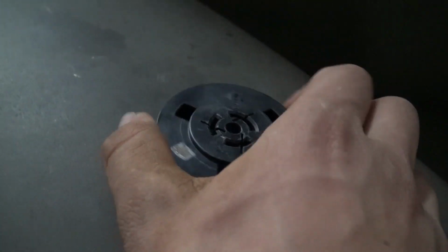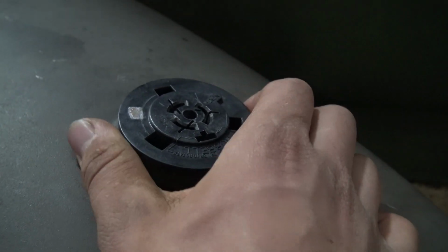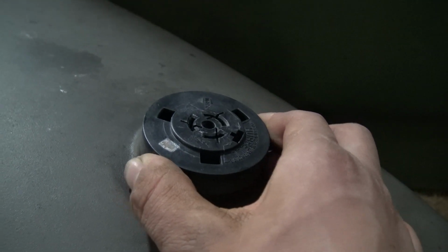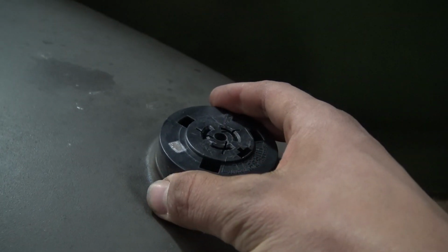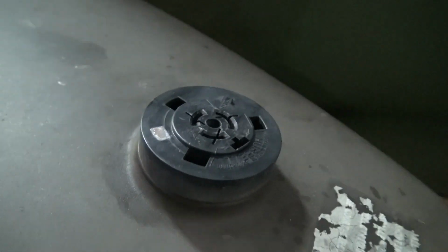This one's a little bit more broken, and that's because the electricians actually did some modifications to this fixture, so I kind of had to fix it. But this is basically a one-and-done snap-in photocell. Once it's snapped in, you really can't readjust it unless you get inside and undo the securement clamp, which I'll show you in a minute. But yeah, you can't really move it right now.